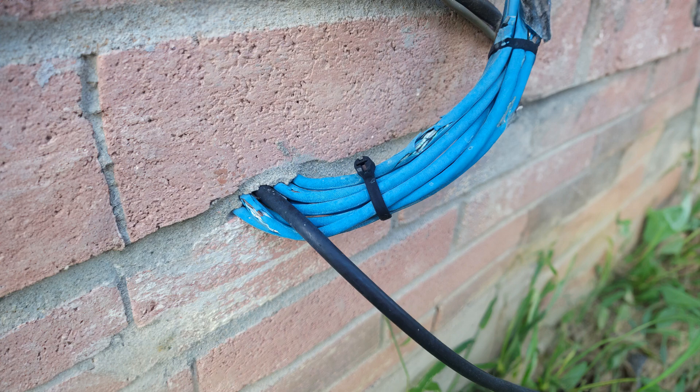You should only have what you need — it's called your feed cable, and it should be just one. You can use outside wire, but if you put a box, you should have a box over your cable where it comes out the wall. Sometimes there are plastic boxes with snaps on the side — you can also lock them so people can't get in and mess with your cable. There should be a box there. If you look at this picture, a box would fit right over that hole. The cables come in from the back of the box, and you just wrap up some extra cable. Then when AT&T or Cox puts their box right up against yours, they just feed right across.